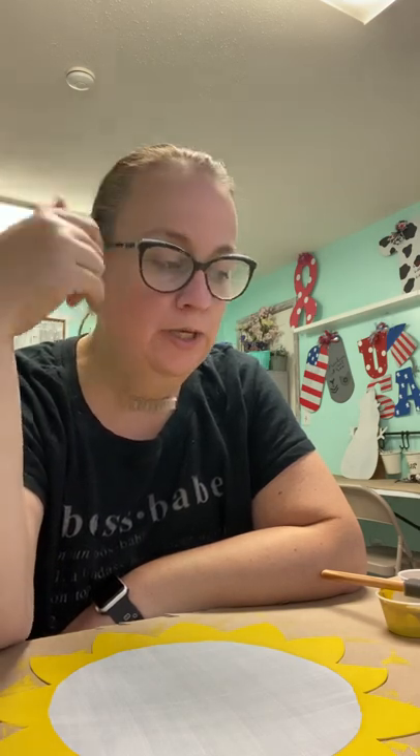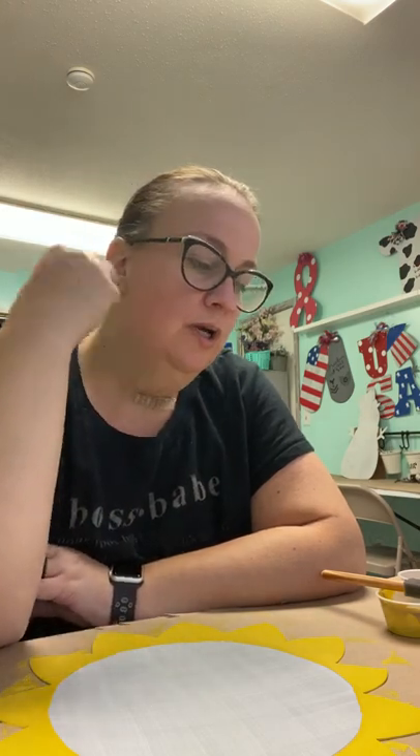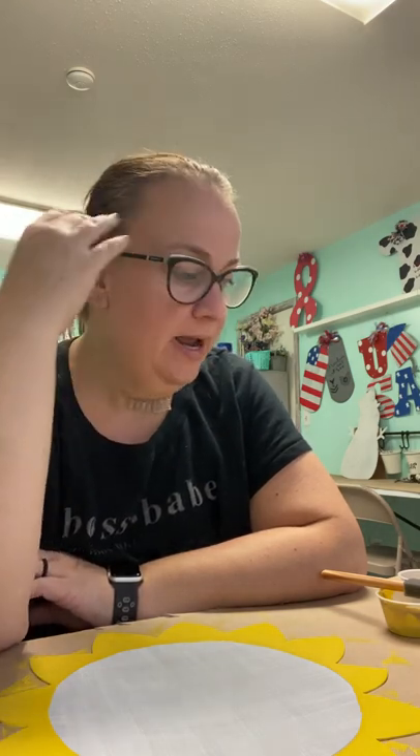If you're using yellow and didn't add brown to it, you may have to do a third coat and that's okay — but three is your max. Three strikes, you're out, three coats, you're done. The reason is that by the time you get to a fourth, fifth, or sixth color coat, it's going to get real thick, real gummy, and it's just not going to have a good look to it.